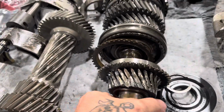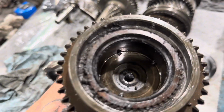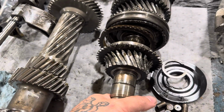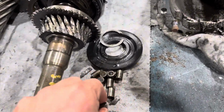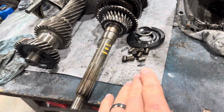However, on the back of the input shaft is what's left of a roller bearing, which was in, I'm guessing, a plastic housing like that, which was gone, disintegrated. That's what went bad, causing this shaft to probably shift from the weight of the gears, taking it out of alignment with these, messing up your teeth, and grenading it. So therefore, it was an input bearing that was bad, that did cause this, so it is the culprit.